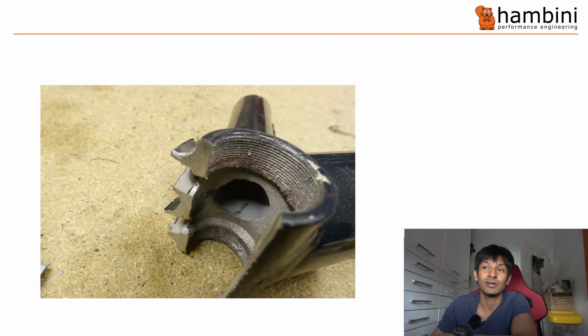And this is what happened when I chopped it up. So a guy called Andy sent his frame in, and I think he subsequently went after Neil, because this was really an accident waiting to happen. The welding on it was appalling. This may not be so clear on here, but there's a lack of penetration. And that was just probably one of the nice things in it. I'll link to a video so you can see what happened before.